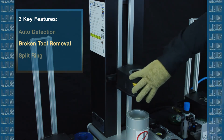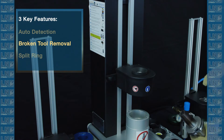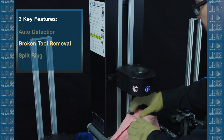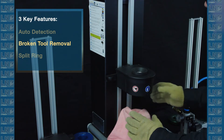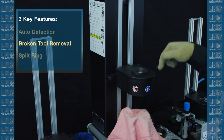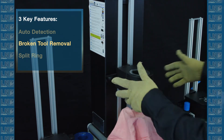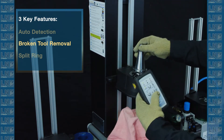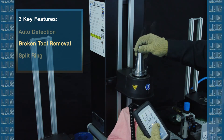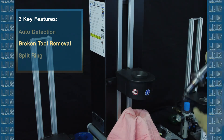The heat inductor can rotate 180 degrees, allowing something like this to be fixed. First, we put a rag where the pot would normally go, because I'm going to turn this head 180 degrees and the tool is going to fall down. Turn this 180 degrees like so, then put the holder in like so, and heat. And there you go.